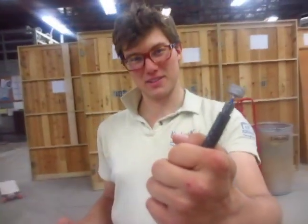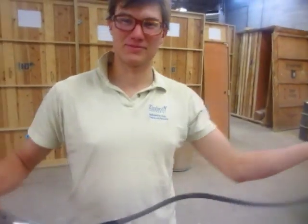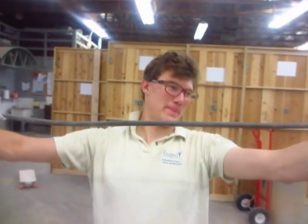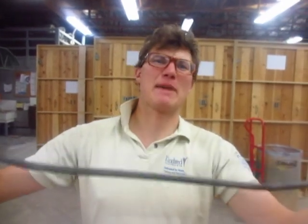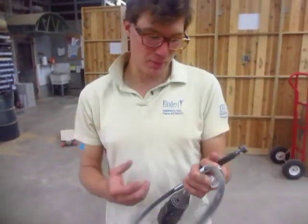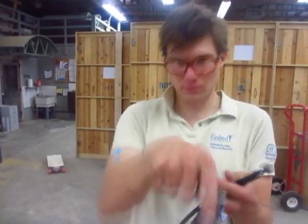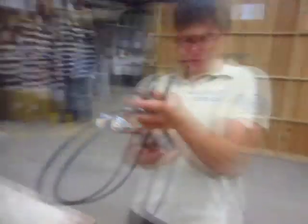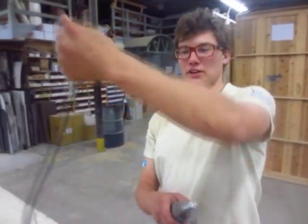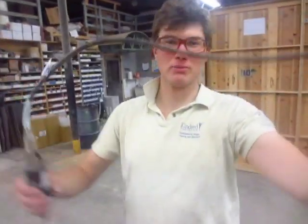What is it achieving? It's achieving flexibility in every direction but torsionally. I believe it's actually called torsion cable — that's what they use inside of it. Whatever it is, we're calling it torsion cable. All it is, is a coil of metal that's able to flex, but when you apply a torque load in a spiral down its length, it will transfer the energy from one end to the other without inhibiting the flexibility of the cable too much.